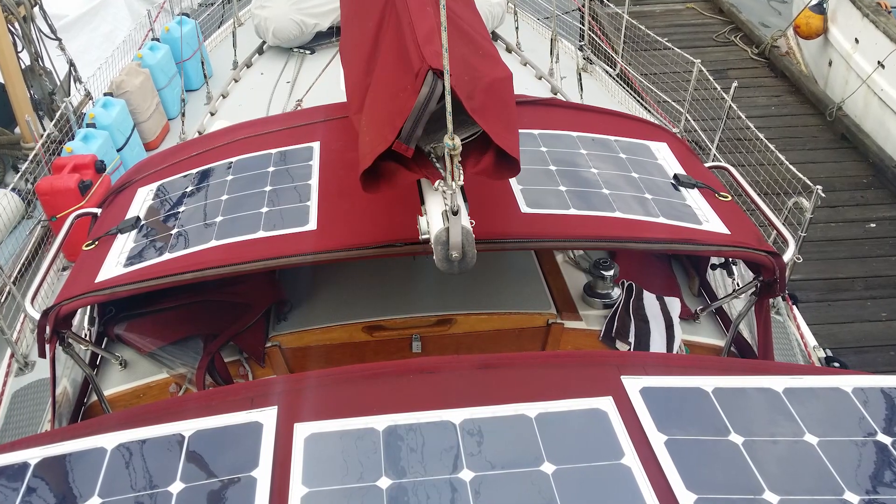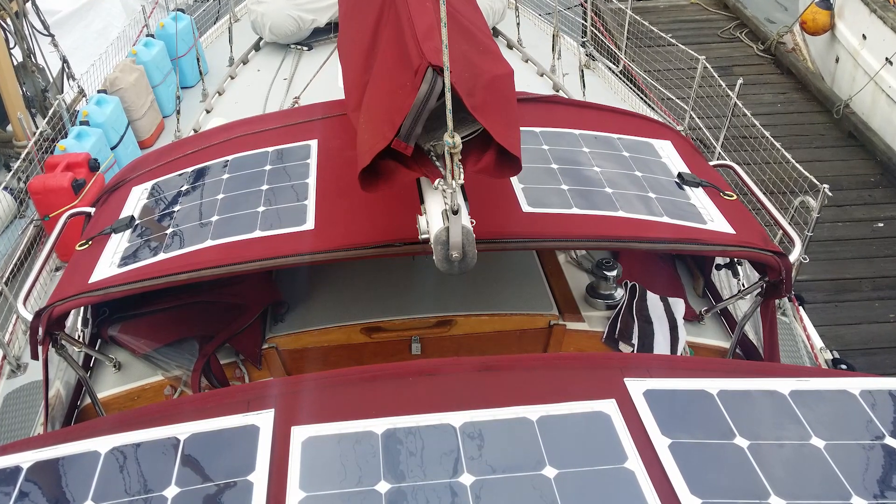I do that because I have two backups to shore power. One is the sun. Assuming the weather's good, I've got a significantly large solar array — not a coincidence — and that acts as a backup. In the event that I'm actually disconnected from shore power, pretty much nine to ten months of the year, my solar array is significantly large enough that I can basically offset the loads of refrigeration, even in the shoulder months — not the winter months. December, January, maybe February is hard, but I can certainly do it from April to October. So I have a solar array that can maintain and offset just refrigeration loads.